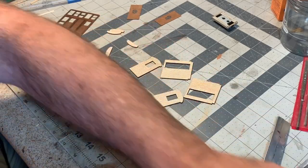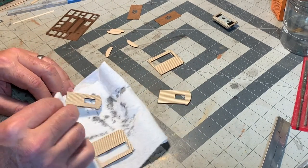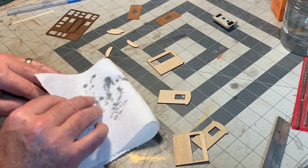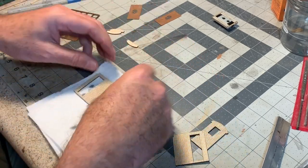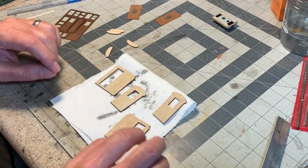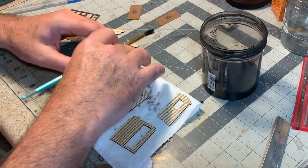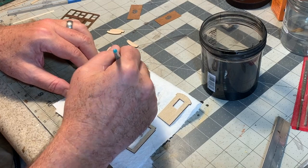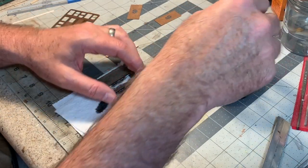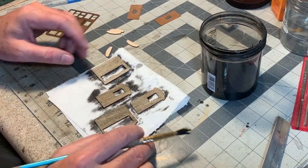Okay, so now get my wood stain, and I'm using an India ink and alcohol stain because I want a gray silvery look to the walls underneath the paint, where the paint has worn away. You'll be able to see this gray silvery look. Where's that? There it is. Remember, it's a good idea to do both sides to keep the piece from warping. In fact, it's actually a better idea to start on the back. All right, set this stuff aside to dry.